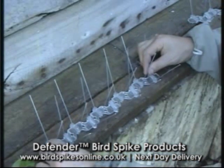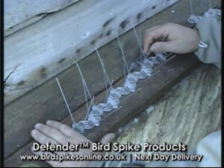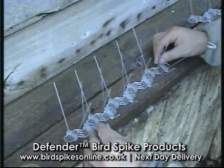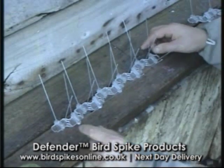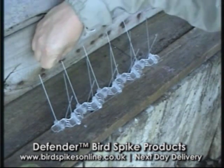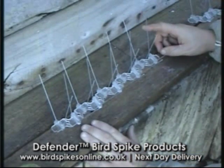What you could do, if this was just what I would call a daytime observation post, just a ledge where pigeons occasionally land, is move one row of spikes back slightly. So the spikes were only just overlapping the front edge, and there wasn't much of a gap. You can't get your fist in behind. And in that situation, just 1 row of spikes will do.